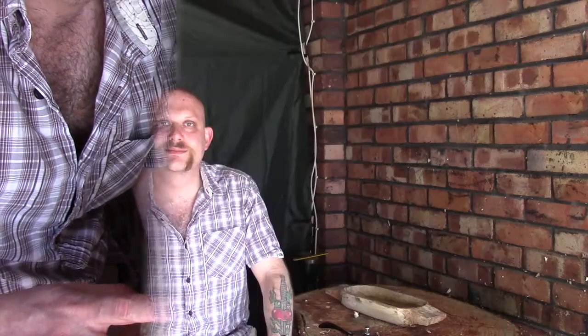That was just a very quick introduction to a really useful tool that I certainly don't make enough use of myself. Whether you're a veteran woodcarver or just starting out, these can be picked up for probably five to ten pounds online, or cheaper from a second-hand store or car boot sale. Once you've got your head round setting them up, getting the blade inserted properly, and making sure you haven't got too much sticking out, they're really versatile tools. For anything with a curved wooden surface you want to smooth down and get rid of tool marks, a spokeshave is a great way to do that. I hope it was useful — comments and questions below, hit like and subscribe, and I hope you'll join me next time. Thanks guys!